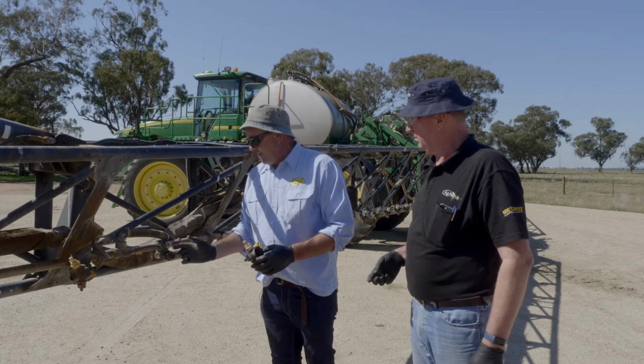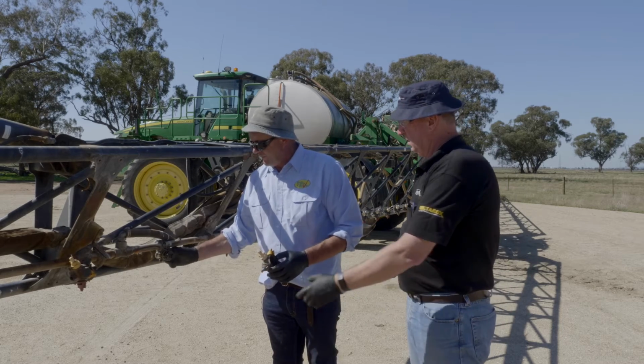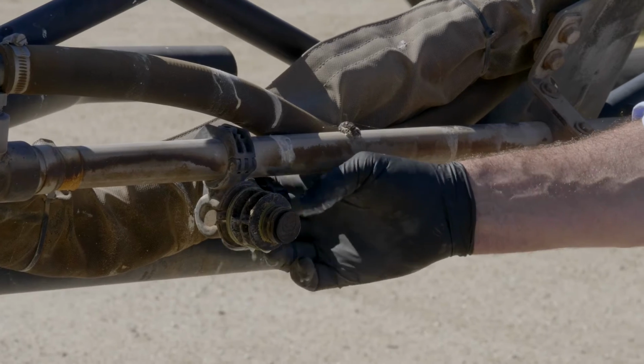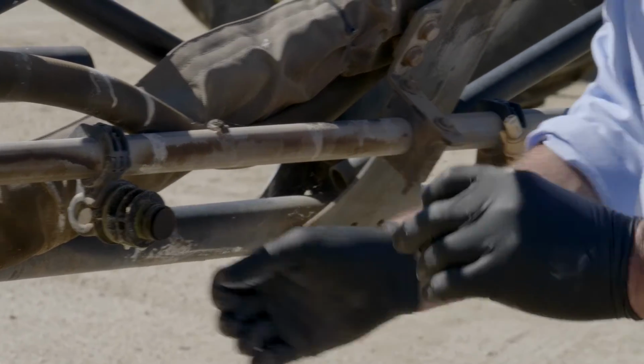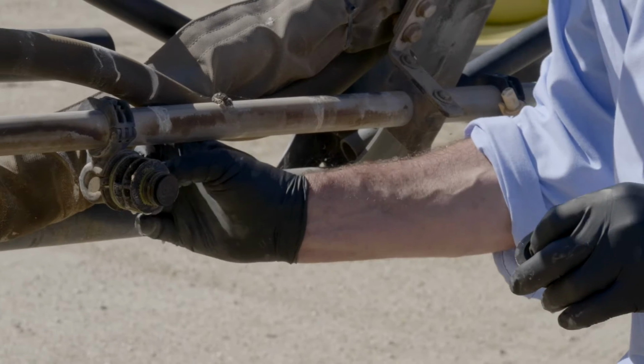Again, having some spares here for O-rings when you go back together. The other thing I'd pay attention to, once I've got that off, is our diaphragm check. And if people have left atrazine and diuron and stuff like that in the sprayer overnight, it'll really start to build up in here.